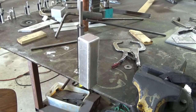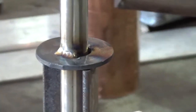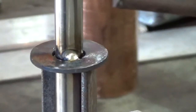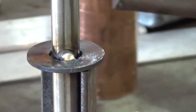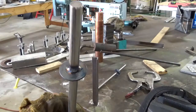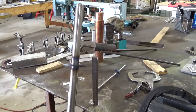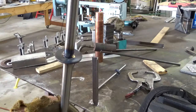Okay, that's all I'm going to do for the welding. I'll show you about how big of a weld I put on there — just a little tack, just to keep it from leaving. Another little tack on that side, that's all I need. If I was using a stick welder, I would just put a tack on there — it's nothing structural, just to hold it on. Another reason I like to put just a couple little tacks on these is because if you put too much weld metal on them, they would tend to warp, and then they won't spin freely in the wind. They'll only spin freely once you get them installed in the bearings.